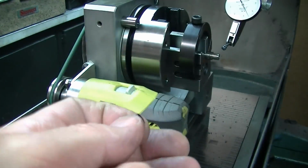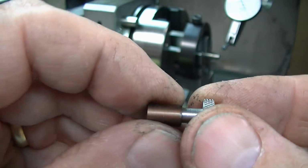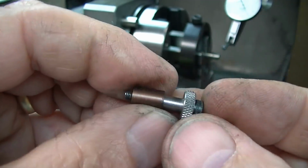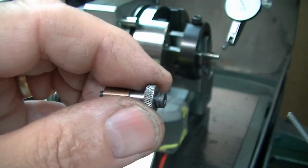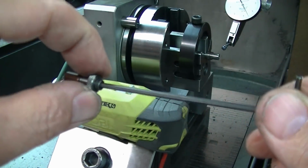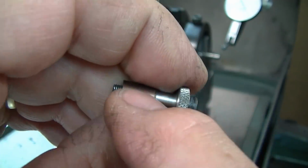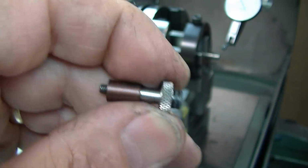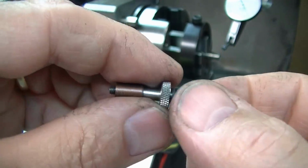So this is the piece that is part of the magic to put in your tool room arsenal. When you have something that you need to not move when you're indicating, you make this intermediate piece, and this goes in and acts as a counter bore. The longer M3 screw passes through. This distance here is just for grinding wheel clearance. The knurl is so that when I go to tighten this, after I've already snugged it, I resist the torque I'm applying with this hand with my fingers here. So I'm twisting, counter twisting, such that there's no relative motion between this and the part. Therefore nothing is scuffing it around trying to push it around. It's pure axial force. I've done 50 or 60 of these this way, and this basically does not move. I've tightened every single one of them that way, and they stay right where it's indicated.